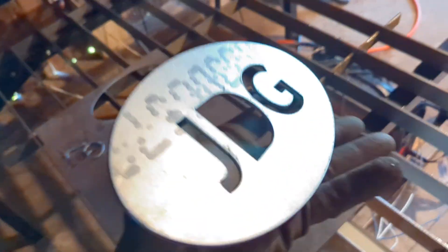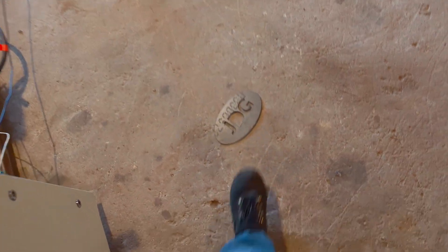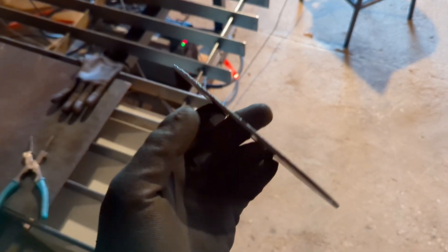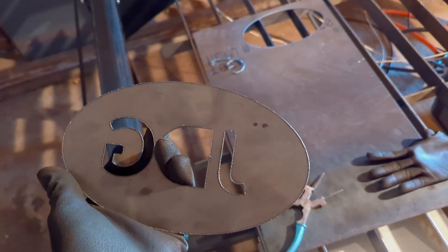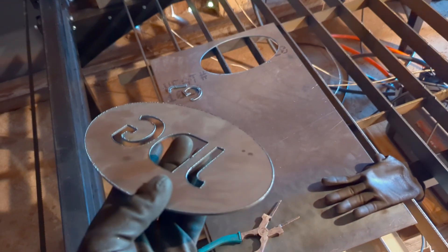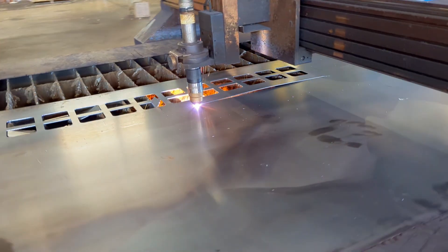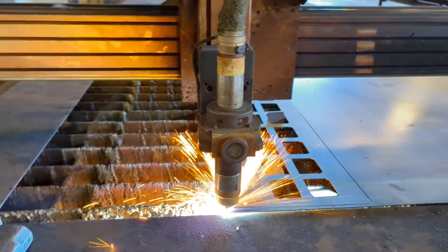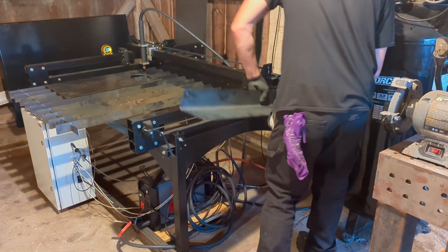I don't want to be that guy — literally every guy who's ever made a CNC plasma cutter cuts their first piece, flips it over, and says 'wow, very minimal dross, look at that, it just comes off with a fingernail.' No — there's a lot of dross on that. I've used the Hypertherm and Messer system at work where it's almost non-existent, so that's my reference point. But used consumables and other factors affect that. The dross can be chipped or ground off, so still good. Going back to the air problem: I'm 90% sure the first test run didn't work because the 25-foot cord wasn't purged with the cutting gas, so on initial start it probably threw an error.